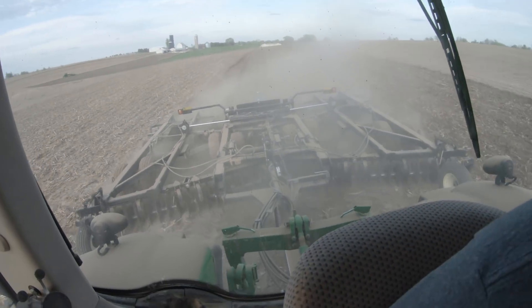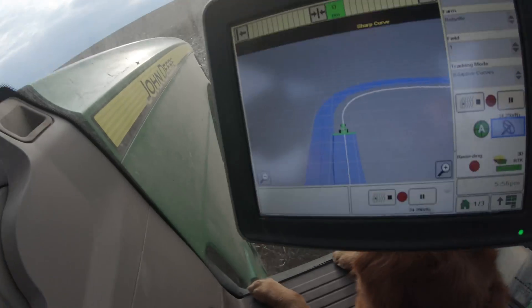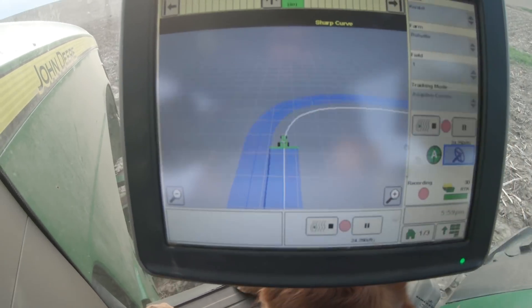Now you're basically free to watch the vertical tillage tool more closely. If you ever need to take over, all you've got to do is move the steering wheel and it'll quit. I was having trouble earlier and noticed something — I might do a video on it. I actually was looking back when it happened, so I knew something went wrong. You don't absolutely have to have auto steer — there's a lot of controversy on whether people really need it — but I can really see and tell how much it saves me in overlap, which means saving time and money because I'm not burning as much fuel.